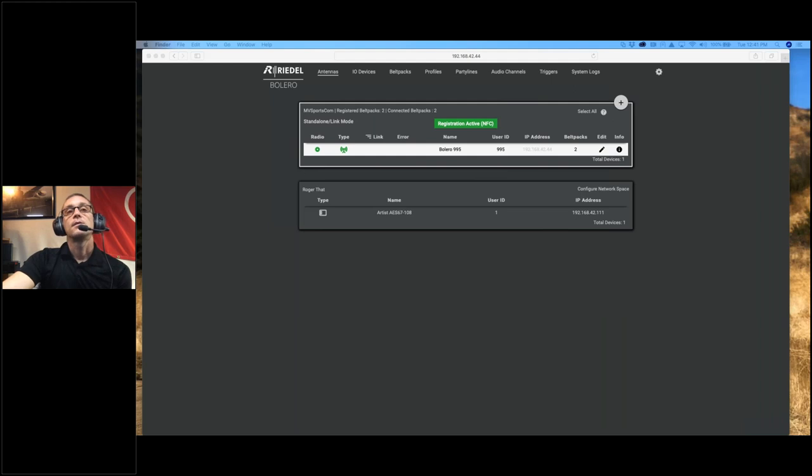Hold on. We've got 12 for transmit and 12 for receive. Those are time slots. And I think Dave talked about the time slots early on in the presentation. Two of those are set in there for play nice and handover. Overhead, okay. Yep, and so that's how the other systems can talk and register, and one belt pack can wander onto another antenna. The antenna can tell you that it's full and those kind of things. So they're reserved. So that's how we get to the number. Okay. That answers it.